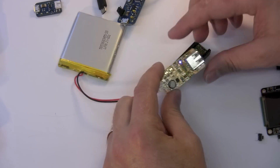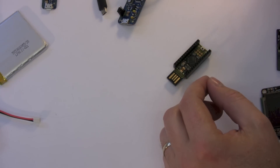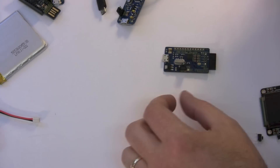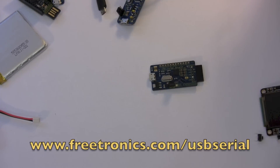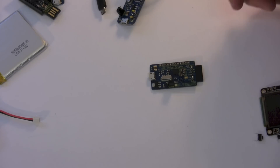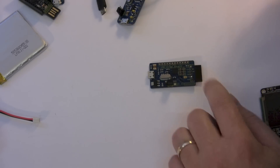So that's a really handy little device as well. Both of those devices will be really good for any battery-powered project. Now we also have this little device — this is a USB to serial adapter, similar to something like an FTDI cable. You plug it into USB on your computer and at the other end it gives you a serial port with additional pins for things like reset control for Arduino boards, particularly DIY Arduinos. So if you put an ATmega chip on a breadboard, you'll typically need something like this to use the IDE to load a program into it.